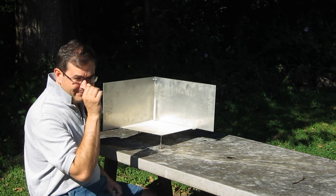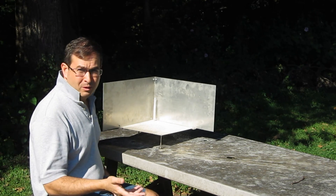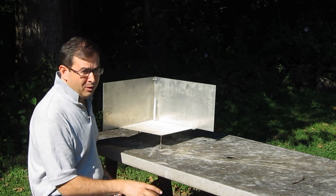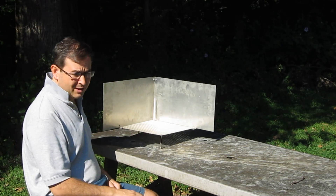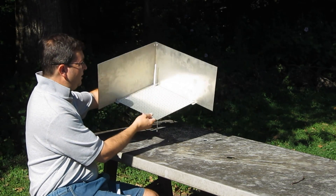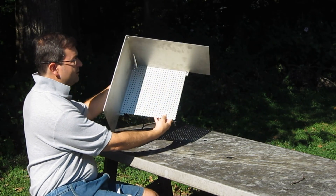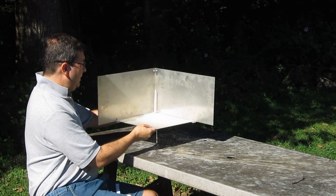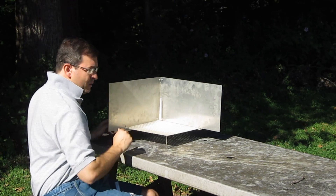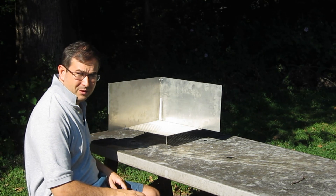I like the corner reflector. I used to work at Raytheon and design antennas for Raytheon, so I'm going to design my own antenna. The corner reflector is easy to design — it's just basically three different planes brought together, and it reflects the radio waves, kind of focusing them down to where the dipole is in the center. What's better than simple?